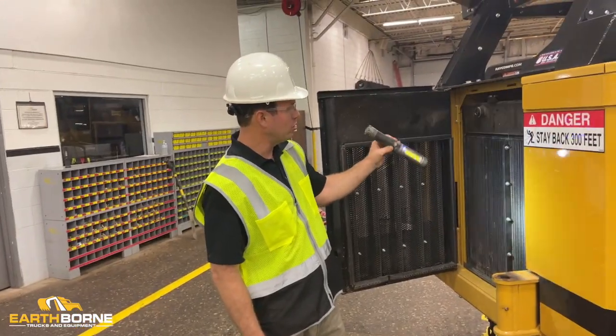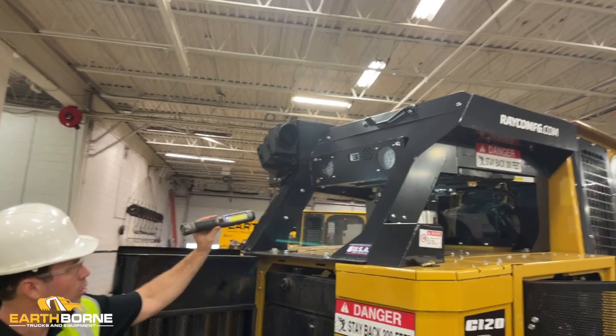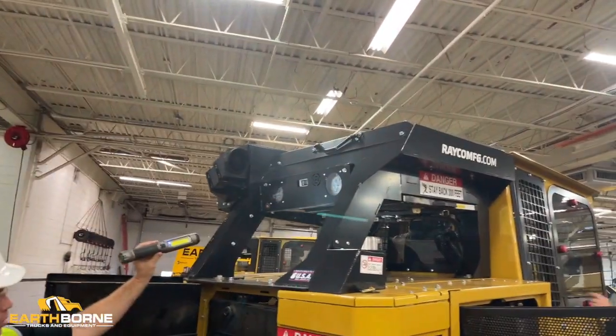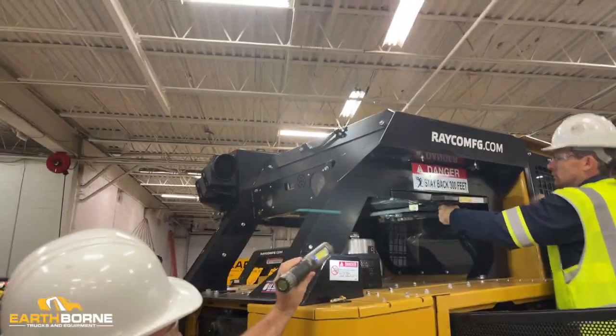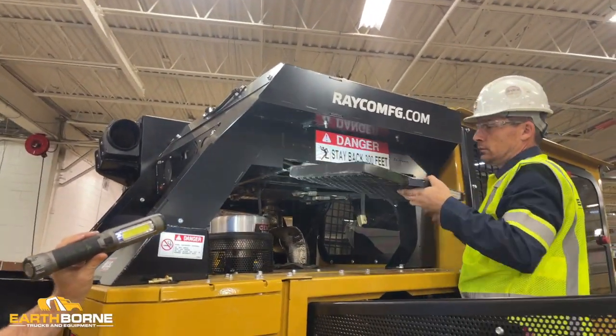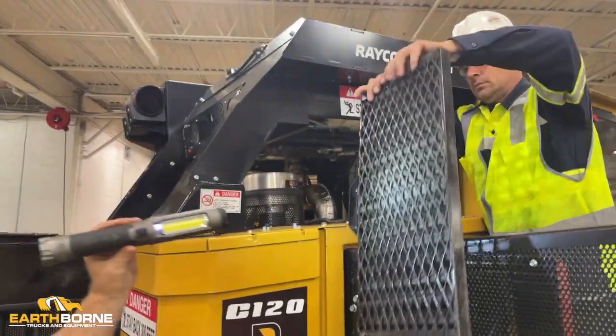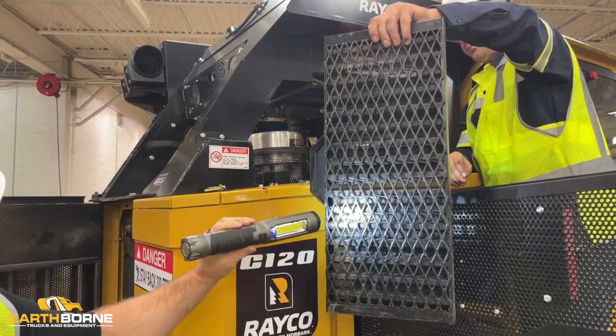So you've got some cooling packs down here, but on this machine, being this purpose built, you've got a lot more coolant running through here, a lot more hydraulic fluid running through it. So you've got a lot more capacity. You have these screens here that Evan's taken out, and these are waffle screens too. With these screens, same thing: you have a bigger area, smaller holes.